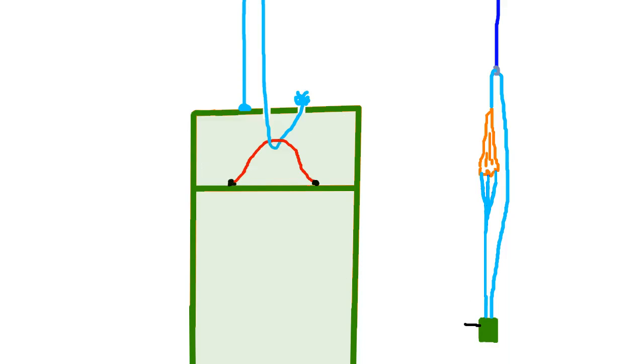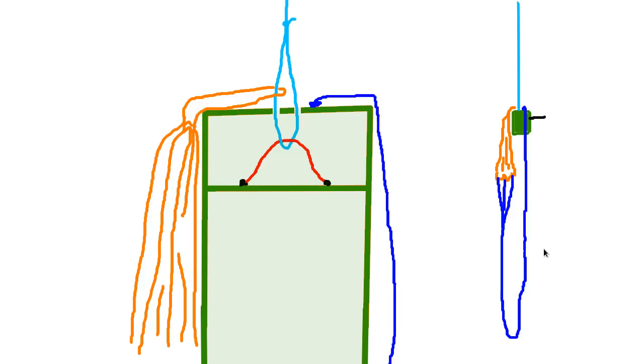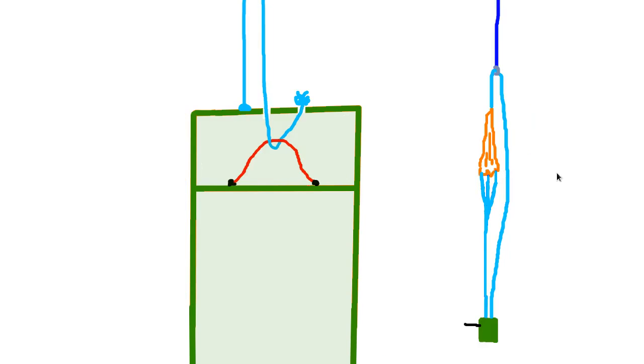And this is very simple to implement, and it also solves all of the problems that we were trying to solve. So it releases above the parachute, so it cuts at the point above the parachute, but the hot wire is inside the payload. It keeps the parachute closed on the way up. There's no sort of dangly bits dangling around to get tangled on stuff.